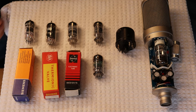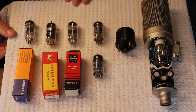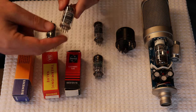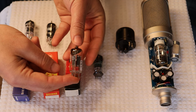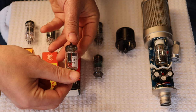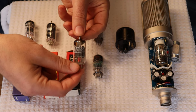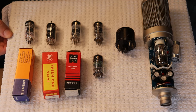We haven't focused much on tubes for microphones until now, but we have quite a few new old stock vintage mic tubes we need to get into the store. Over here we have one of our favorite 12AX7s — no surprise to anybody. It's a dual high-gain triode used all over the place for amplifying very low signals. This one is a Matsushita, one of our favorites. They made great tubes — unfortunately, like almost all great vintage tube manufacturers, they're gone.